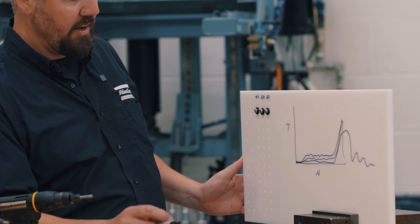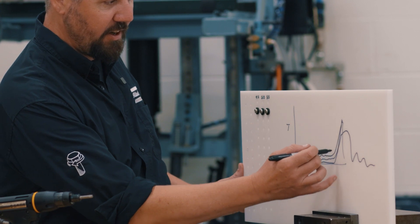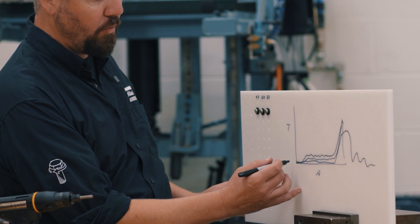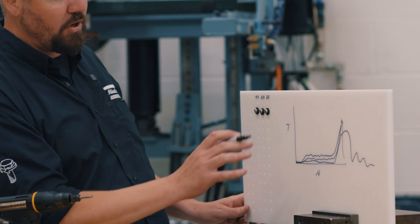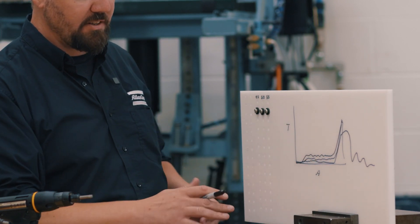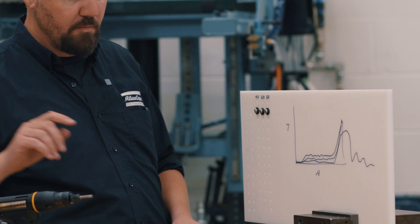The first tightening had the highest prevailing torque and wasn't very ergonomic. The middle tightening hit the target and shut off. And on the largest hole, the last tightening stripped out the threads. We don't actually have this data because this tool doesn't report any trace data.